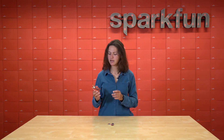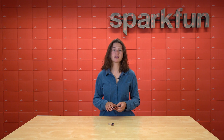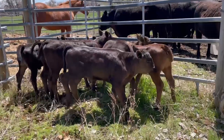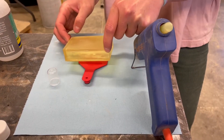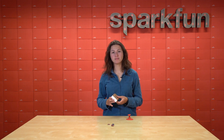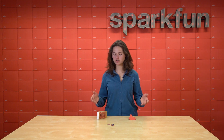However, there's also a shield that uses the same cellular technologies as the Asset Tracker and can still utilize a GPS module. So I did something out of the ordinary and connected the shield to the STM32 Thing Plus through Qwiic, and charged both boards with a LiPo battery so I wouldn't run into power issues. Using a compatible GPS module and a hologram SIM card, I was able to get the system to send GPS coordinates of an individual cow to a phone number. The challenge was getting the tracker to stay on the tag — the tagging material is some sort of super-slick polyurethane that wouldn't glue to the enclosure no matter how much superglue and accelerator we used. We got the actual system to work and send a text message with the GPS coordinates, but the problem was making sure the enclosure stayed on the tag and with the cow. I know it's possible — I'll need some sort of special polyurethane glue to ensure they'll stay together for the long run.